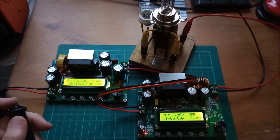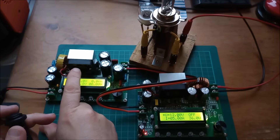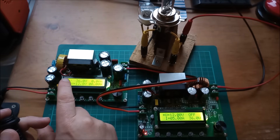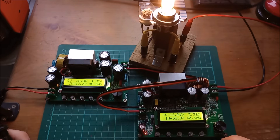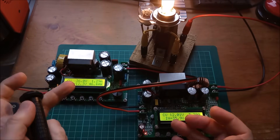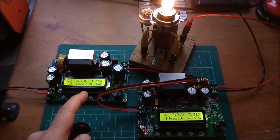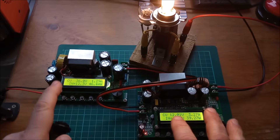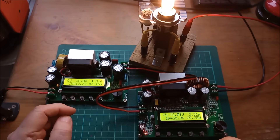Let's see these two little fans come on. The fan on one unit is 5 volts and on the other is 12 volts. You'd think the boost converter fan would be 5 volts, but it appears to be the 12-volt one, and the buck converter has the 5-volt fan. The minimum input voltage is around 10 volts. Turning on a car headlamp bulb at 12 volts, both fans are running — they automatically come on at a predetermined current or wattage. Notably, the boost converter shows 46 watts and the buck converter shows 39 watts, so there are losses in the system and we can effectively calculate efficiency from that.